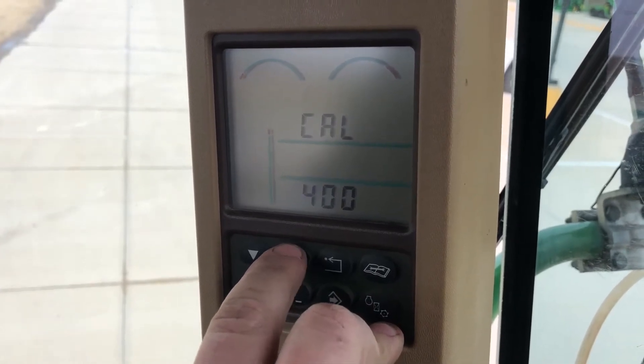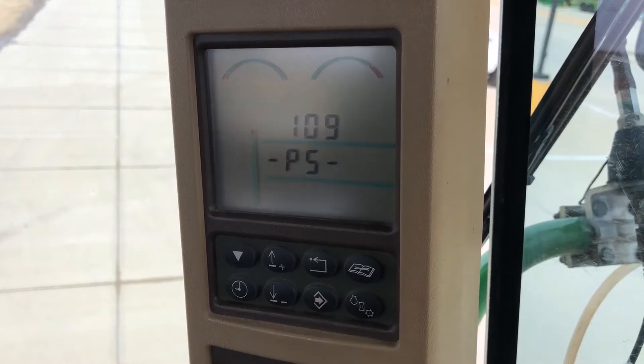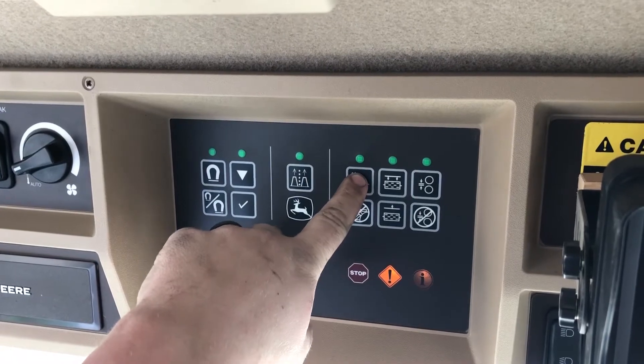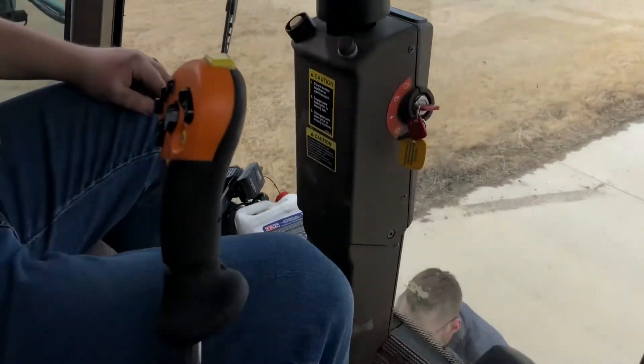— end of calibration. On to address 109, which is door open. Hit the enter key, power saver, then you have to hit the button on the overhead console, and now he's once again in full control of the door.